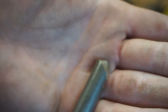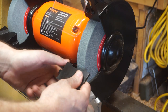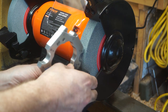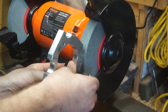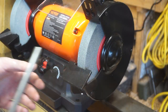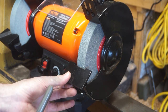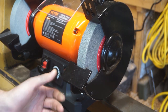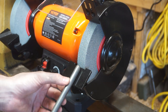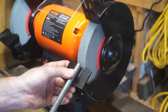So let's go ahead and give it to it and put a 40-40 grind on here. First, we'll use this Stuart Batty jig to set the angle platform to 40 degrees. The next step will be to grind the tool upside down to get a clean 40-degree angle on what will become the cutting edge. I definitely recommend new platforms for this thing. Let's see how quick this 80-grit wheel removes the metal.